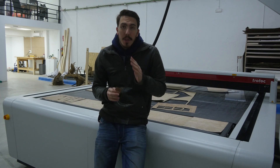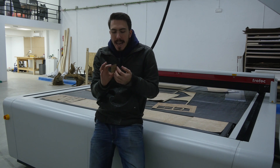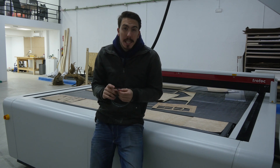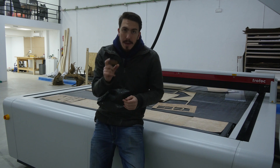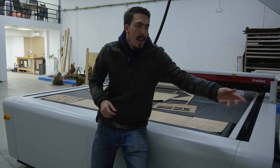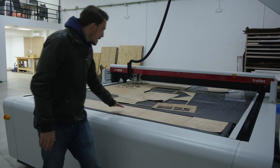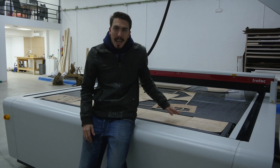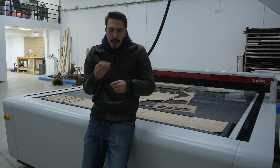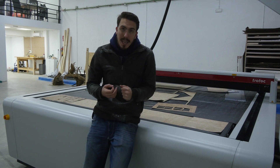Okay, so I've got the card design done. I've done a very mini test to see if I understand the vision system, because the first time I tried it, it wasn't working. The second time it worked, and now I've got all the pages down. I've given them a light sand so that they're a little bit lighter, more contrast - I just find the engraving works out better when they've been slightly sanded.